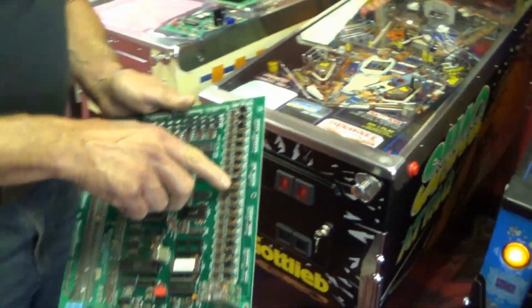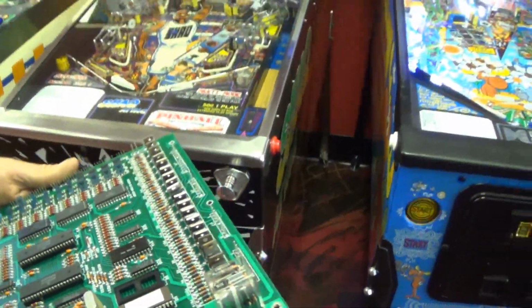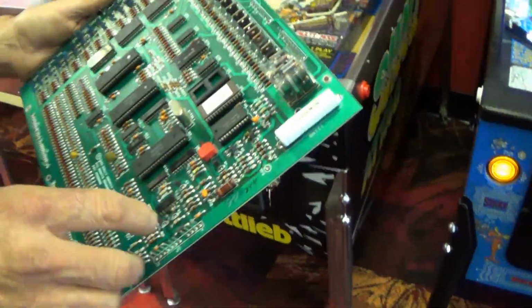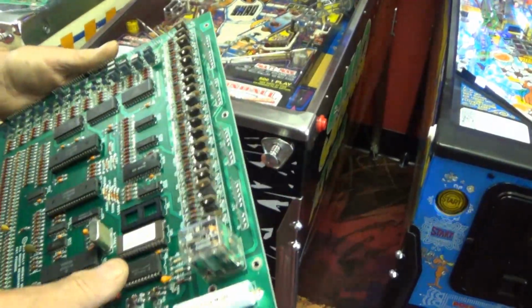Repaired the burned up Q11 with a new transistor. The resistor was open, by the way. Okay, well, we knew that, right? And I would have done a zero power RAM, but I didn't have any good new ones. All the ones I had were really old. I took them apart, they were all dead. They only last for 10 years or so.